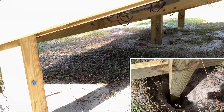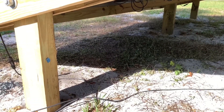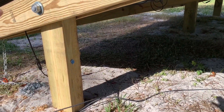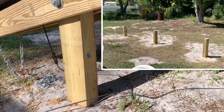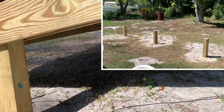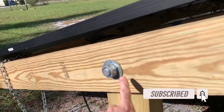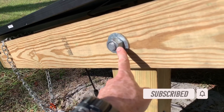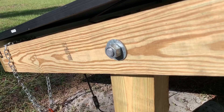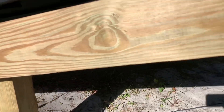Three posts are holding this up. These posts were put four feet in the ground and they each have 300 pounds of concrete on them. These posts are 24 inches above the ground — that's where we cut them off. We didn't want this array very high in the air; the lower it is to the ground, the less wind it will catch. This bolt here is a galvanized 7/8-inch by 8-inch bolt. Research shows these can take up to 60,000 pounds per square inch, so they should be pretty sturdy. We use super strut to mount these.